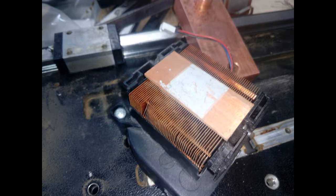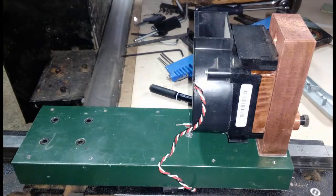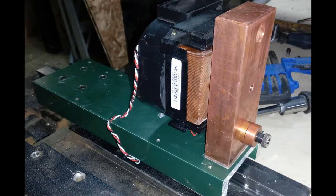You can see the driver coming out — I just put a big hunk of metal with a copper CPU heat sink on top with a variable-speed fan controlled by heat. I have to say this was a little bit overkill, because the laser doesn't heat at all. I don't even think the fan speed revs up even after an hour of continuous lasering. It's important to say that the aluminum mount was also machined to behave as a heat sink as well.